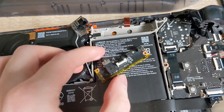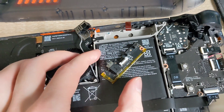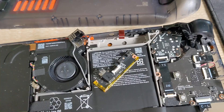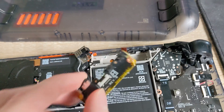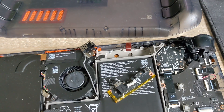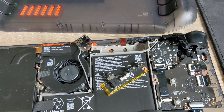I'm not sure if it's going to come across in the video, so I'll have the raw WAV files in the description for you to download and listen to yourself. But to me it definitely sounds like there is an improvement when you completely isolate the ground from this board, which could mean there is some sort of ground loop going on. I'm a little bit surprised.